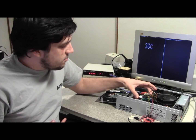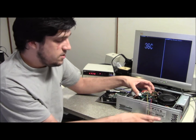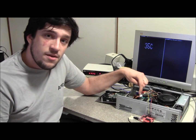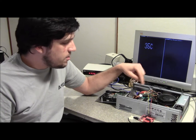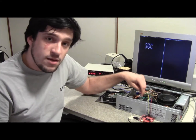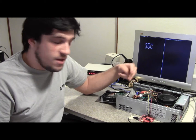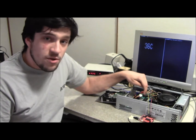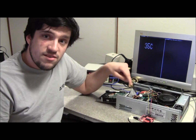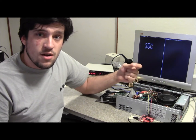So I built this small board right here. It has an MSP430G2452 which I programmed with a Launchpad — yay Texas Instruments. This board also has a floppy drive power connector so I'm powering it from the actual system's main power supply. It has three headers for the three fans: two three-pin fans and one four-pin fan. The MSP430 uses sets of NPN and PNP transistors to drive them, and then a thermistor which I have routed into the center of the CPU cooler to actually monitor the temperature of the CPU.